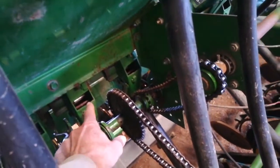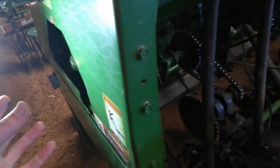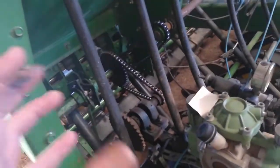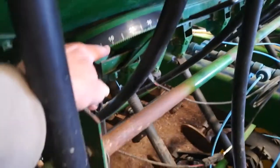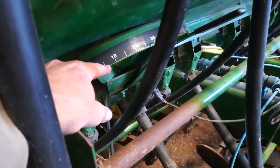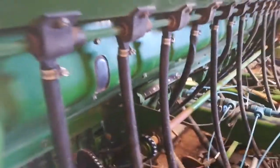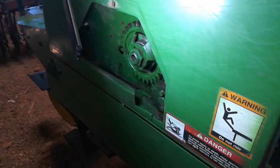What these half-speed gears do is: instead of having let's say a quarter-inch slit in the seed cup, you could double that width because the gears are only turning at half the speed. It lets the seeds flow a little bit better and you get more sensitivity. I was down here on the scale at like seven or eight when it goes up to sixty — it's not very sensitive, there's a lot of slop in it. It was a real challenge.